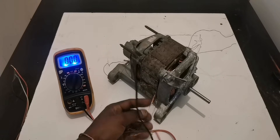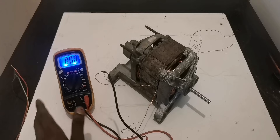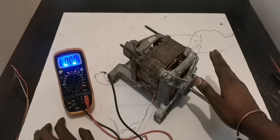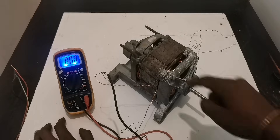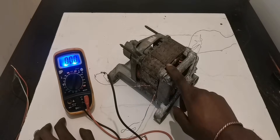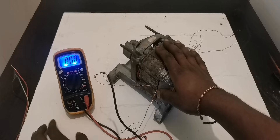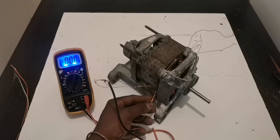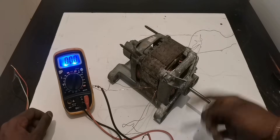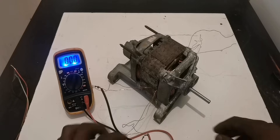If you're going to power something big, then it's good to leave your wires double like this. But if you know it's only for light bulbs or something less than 200 watts, then you can connect them in series like this side. This motor was 300 watts, so I believe the watts we can produce here will be more than 300 watts. If you have something over 300 watts, you have to leave your wires double, but you will need something with high RPM to spin here to reach 220 volts.